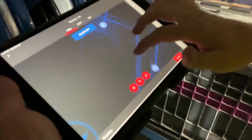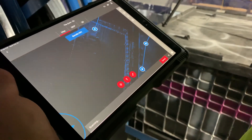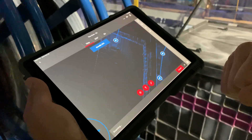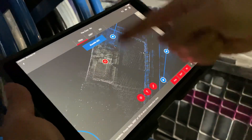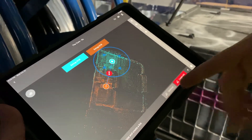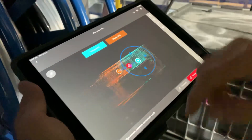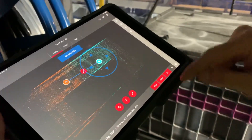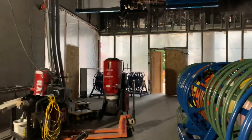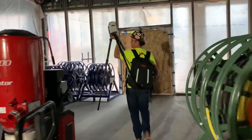As this finishes up it's going to pop in and jump right over here onto the side. There it goes — there it is. Now I've got overlapping data, so I can go link, click, click, start alignment — it's already there — so I say optimize and now it's real tight. You can see the edges look good all the way around. In elevation view it's really looking good. I'm going to say create link. Now I'm going to go back where those doors are and open them up, just right there at the doorway so we have really good overlap, and then we'll be done with this.